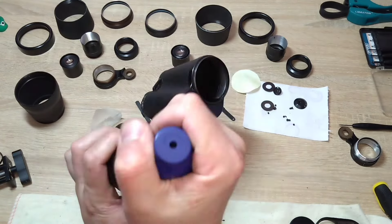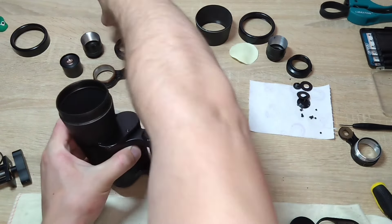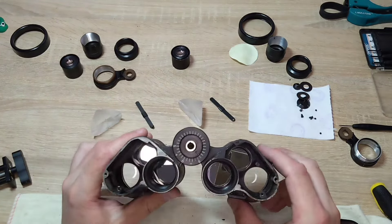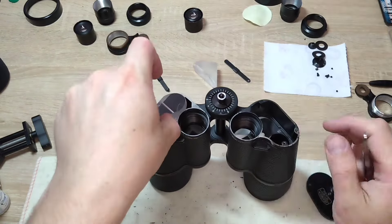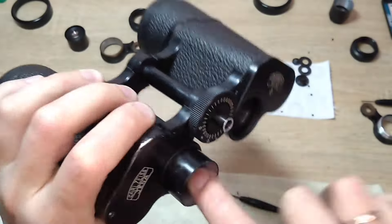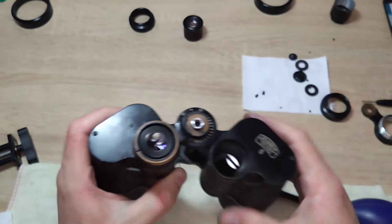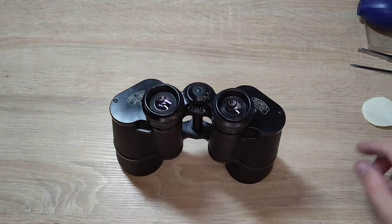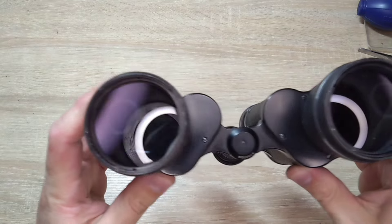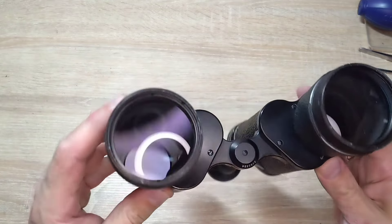We screw on the lens body, which consists of two parts. After that, we take the lens with the adjustment ring and insert it into the binoculars. We slightly screw it with the clamping ring, but not too tightly. Now, from the eyepiece side, we insert the prisms. We securely mount the clamping spring and close with the covers, and tighten it. Next, you need to apply some oil — not too much and not too little — so that the eyepieces move up and down smoothly. The repair and cleaning of the binoculars are complete; only the collimation remains. The binoculars are only slightly misaligned, so I will carefully adjust the collimation rings on the lenses, and I think they will be completely functional and ready for use.